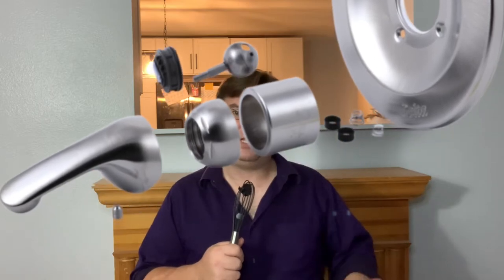There are two dangers here: either the danger of leaping out of the way of a scalding hot shower and slipping, or being scalded. It's not fun. The single-handle shower valve mixer valves that you may be familiar with from 20 or so years ago, that adjusted both flow and temperature by pulling out and going left to right, those were typically not pressure balancing valves and not anti-scald valves. These worked very much like a kitchen mixer, usually using a stainless steel ball and springs similar to the Delta design.